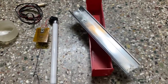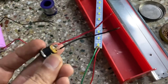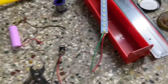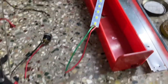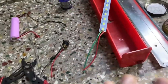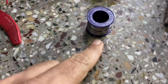This is stage three. I've soldered the two LED strips and joined them end-to-end for the full length. A charger has been tinned to two wires and a lithium-ion battery of 3.7 volts has been soldered in. The next stage will be connecting the circuit that charges the battery from the charger via USB, then assembling all modules into the housing along with the reflector. I'm using solder with flux and 60/40 lead-tin.